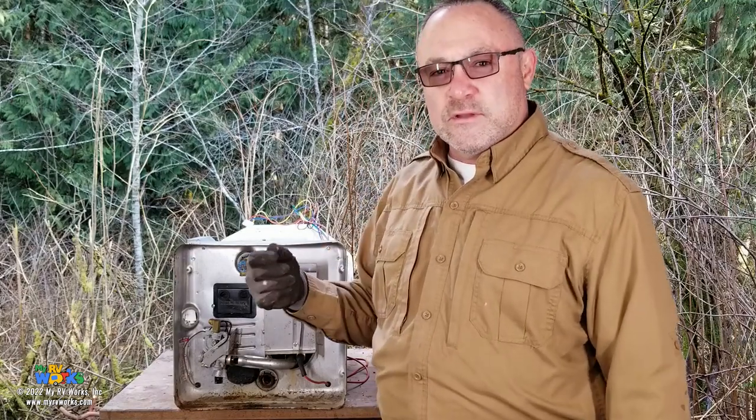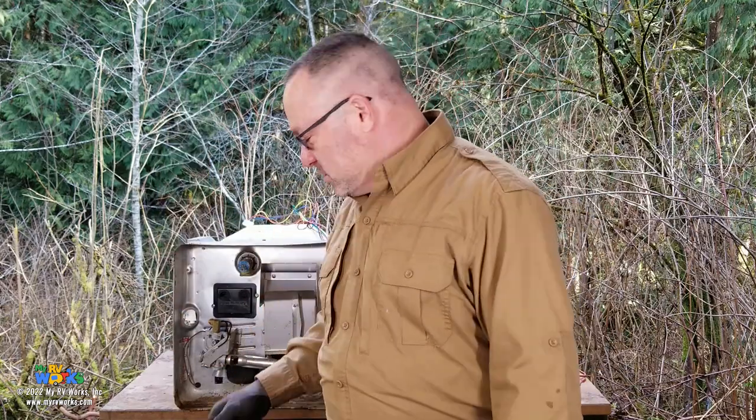And it's always exciting when I do that for a customer, because they had no idea that that was even in their water heater. So we're spraying the stuff, and all this white chunky calcium buildup is pouring out of the water here, and they're just freaking out. If you do not do that to your water heater on a minimum annual basis, but if you are full-timing in your RV, I would recommend doing it every 6 months. It's a simple procedure, and it's like a pay me now, pay me later type of a proposition.